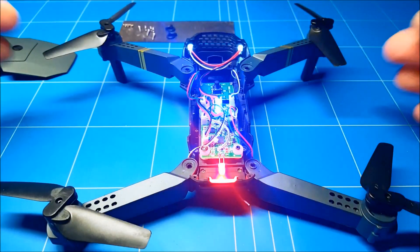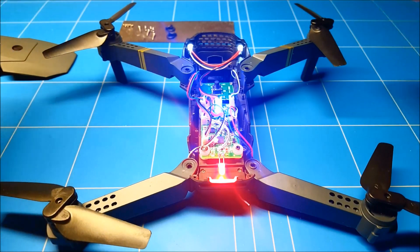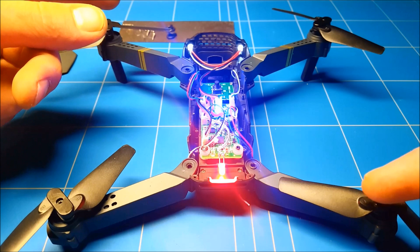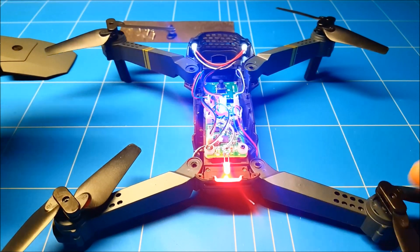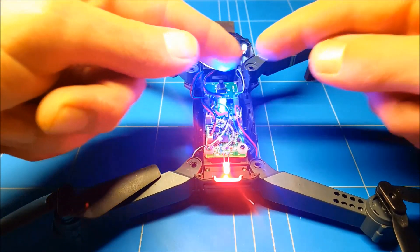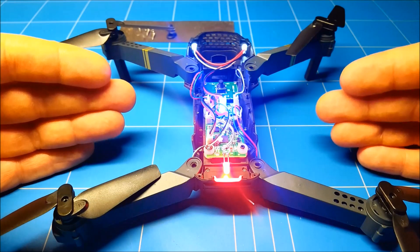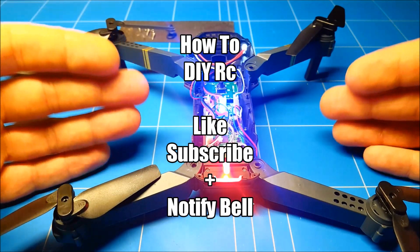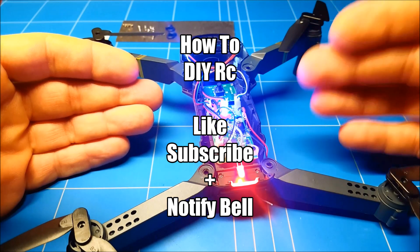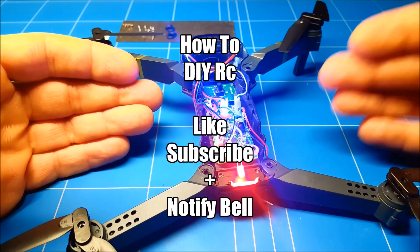Welcome back — we have assembled the drone about 50%. Now it's time to check if the motors are turning the correct way and if the props are sitting in the right place. These two motors are running clockwise, just as the props are scooping clockwise, and these two motors are running counterclockwise. As long as you have these two motors running toward each other and the other two doing the same, you have a good drone that will take off without problems. That's where I'll end the video — I hope it was helpful. Subscribe for the next episode where we'll do a range test of the WiFi FPV.